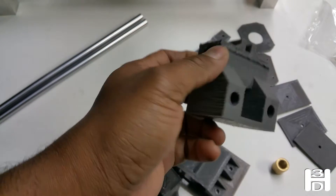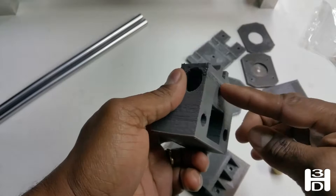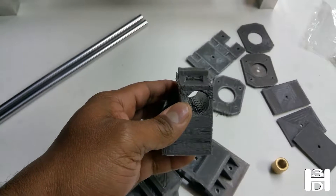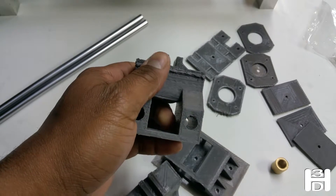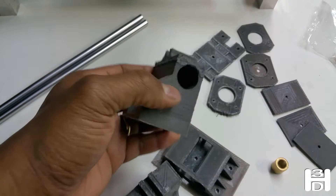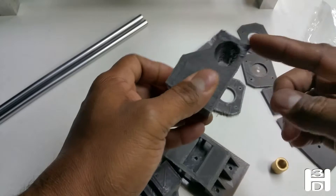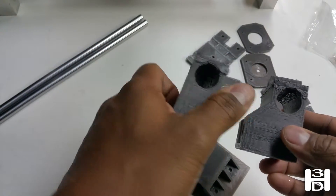In fact, with this print near the end, as you can see this sticks out a little bit more and was set inwards a lot more on this side. My printer did lose some steps, but I was able to recover by pausing the print and then manually moving back into the approximate position to allow the print to finish. I didn't want to stop — I had come too far with the most important precision parts here at the top, and I figured I would just make this work.